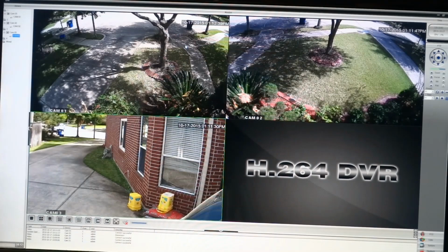You see, these two cameras are the more expensive cameras that I bought extra, with the 2.8 to 12 millimeter zooms. I had them all the way out on wide angle at 2.8 millimeters because I really like the very wide field of view. I can see a big area. I've got overlap. You can see this sidewalk is in both cameras, so anybody walking up to my house, I've got a nice clear view of them and a nice view of the driveway. I even go into my neighbor's yard a little bit, and on both sides actually. So I really like those cameras for the wide angle.